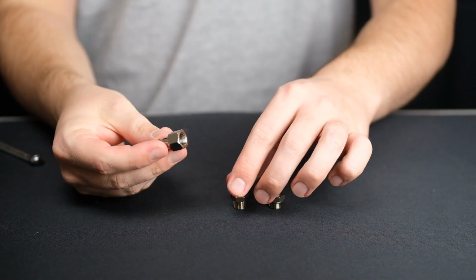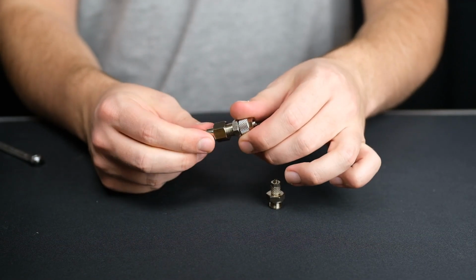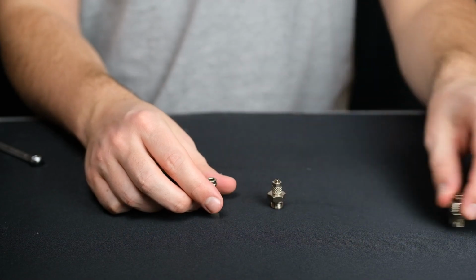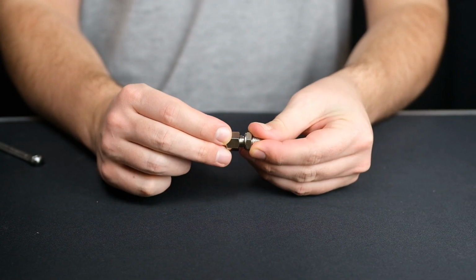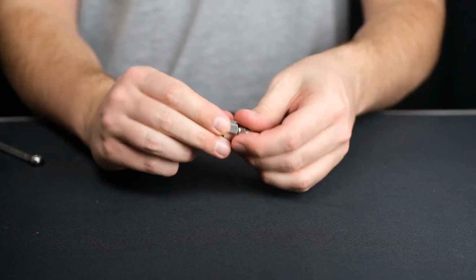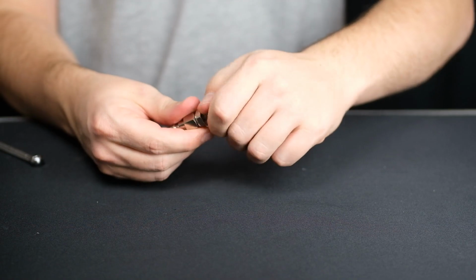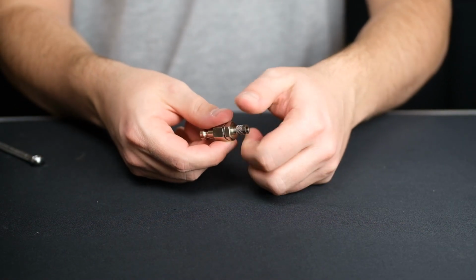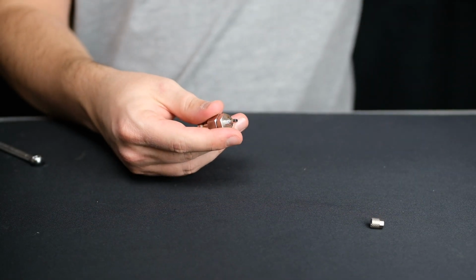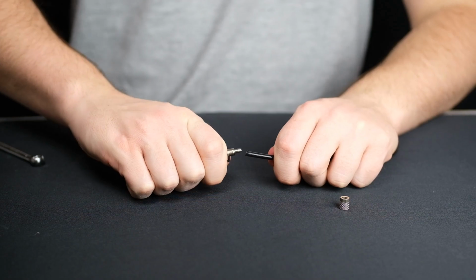For those who got some secure connectors, they are quite simple to assemble. The 4mm ones come with an O-ring, whereas the 6mm ones do not, so it's a good idea to apply some PTFE tape before screwing them in. For both, you need to unscrew the locking ring, then push the air tube onto the nipple and put the locking ring back on.